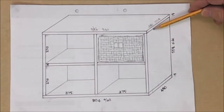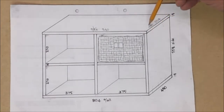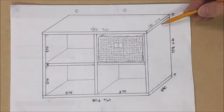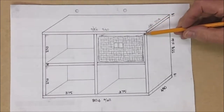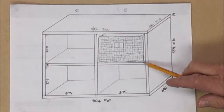Fixing-wise: screws through the bottom and locating dowels for all of these panels. The top panel will only have concealed locating dowels because I don't want to screw through the top — filled screw holes tend to show up a few months after painting. So to support the top panel I'm going to insert aluminium angles underneath, and for the middle shelves as well.